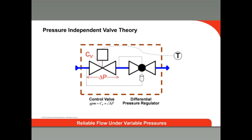To meet various applications, Honeywell's pressure-independent valves come in a wide variety of flow settings. The valves are sized by the gallons per minute they can deliver when the control valve is fully open. As the control valve closes, flow to the coil is reduced, but the balancing valve section will keep the pressure drop across the valve constant. This is the function that is key to keeping the system balanced as other zones modulate. Select the correct valve by choosing the valve that matches the coil design flow rate — select the smallest valve capable of delivering this flow, but round up to the next size when needed.